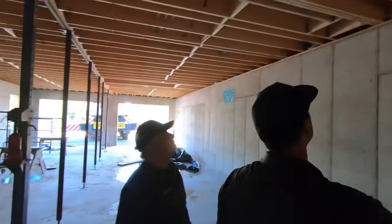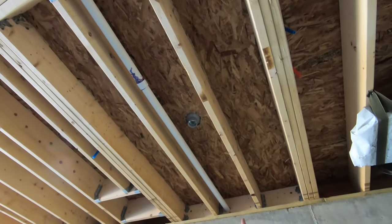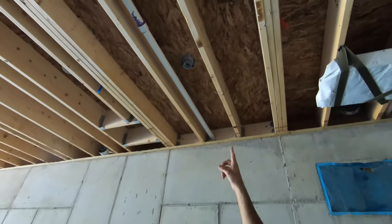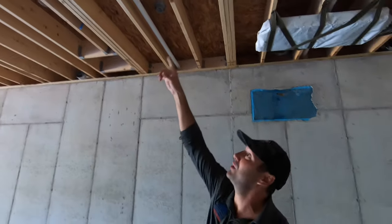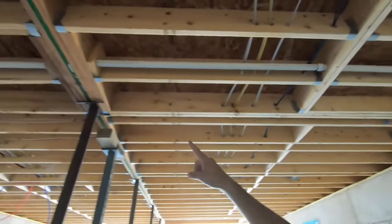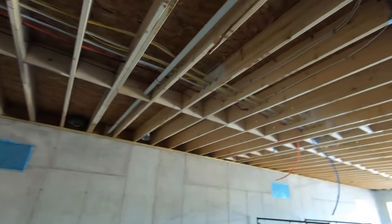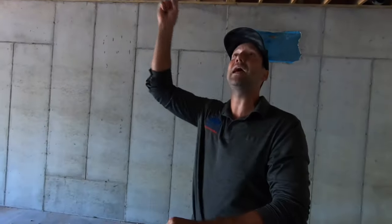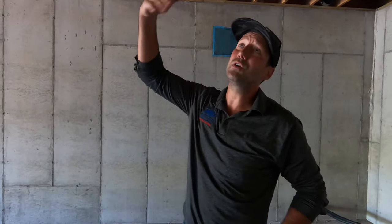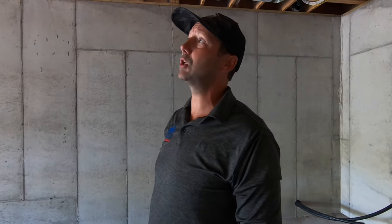You've got your drop here for your master tile shower — this is your big tile shower. You've got your drop here for your drain, which your plumber can collect and send out. What is this pipe here? This is the pick point. See how it comes out there — it's kind of a bridge to nowhere. When this box is sitting on a carrier and the crane is about to pick it up, we're feeding through that line with our cables and then we can pick the boxes up. To finish, you can just leave them or cut them off if you don't like the look of them.